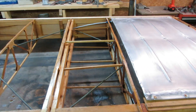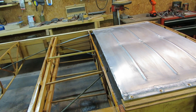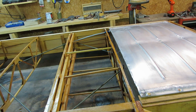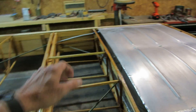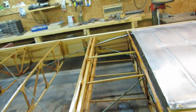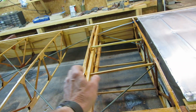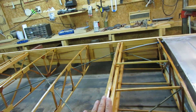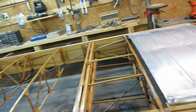Here's another example of amateur stuff. Originally the fabric was going to glue to the tank, and the tank would have taken all the stretch loads. Well, I got to thinking about that and said, if I ever have to take that tank out, I'm going to have a big fabric repair job. So as an afterthought, last-minute modification, I glued some plates here on this rib, wrapped the fabric around and glued to that. I put these spreaders in here so it wouldn't bow in that rib so bad. The plan is to bring the fabric over and around this compression strut, glue it here, then bring one bay of fabric across the top and glue it from the inside of this rib across the top. Then it'll all get rib-stitched together so this little flimsy rib won't be carrying a stretch load on but one bay. That should work.